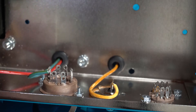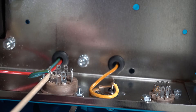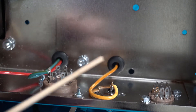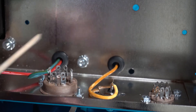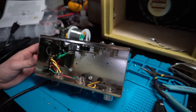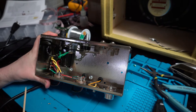The last two wires are run. Got the blue wire coming out of the output transformer going to pin three of the output tube, the 6V6, and the speaker wire coming out of the output transformer going to the center pole of the RCA jack. Neither one of these are soldered yet - they're just in there mechanically right now.